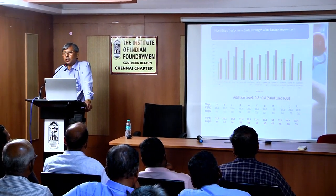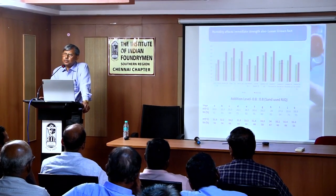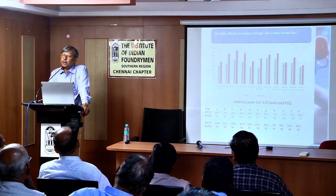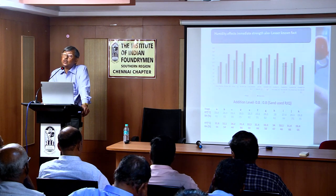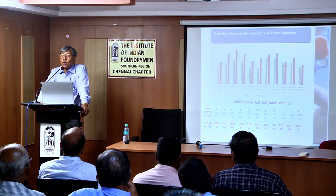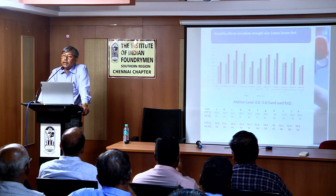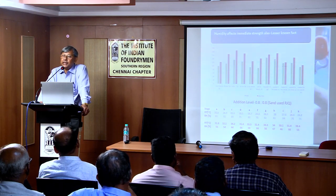Even in the immediate case, starting from mixing, whenever you pour the resin and hardener and mix together, it absorbs atmospheric moisture and strength starts degrading. So even immediate strength is affected. This is a lesser known fact, and to realize this also took time for me. And another parameter you must be knowing is the equilibrium moisture content of any material.